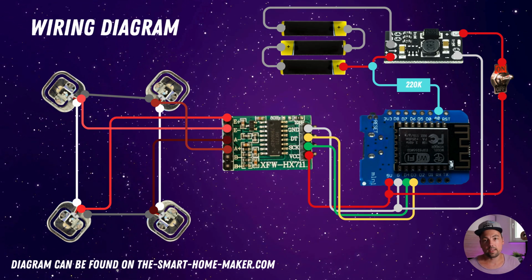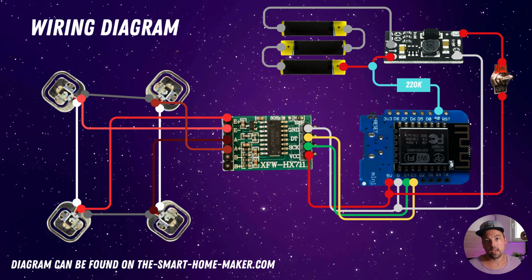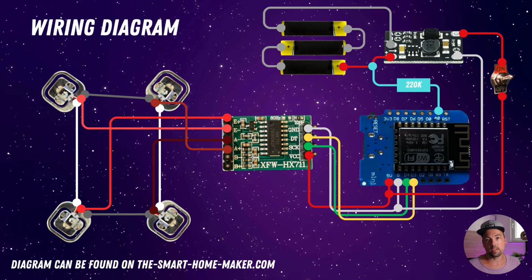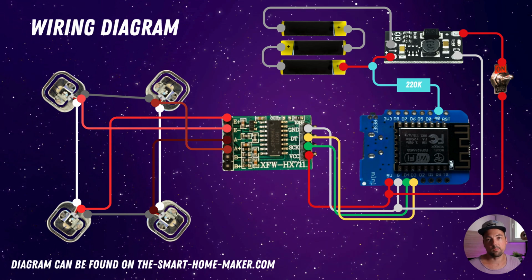Then you connect them as shown in the picture to the HX711 and you connect the HX711 as also shown on the picture to the D1 Mini. This allows us to read out the load cells and get the gas bottle weight.